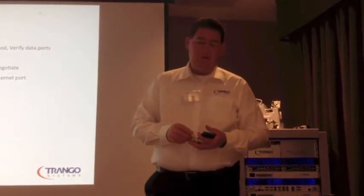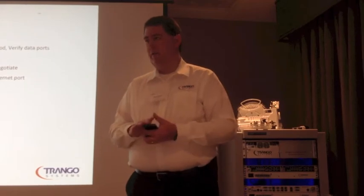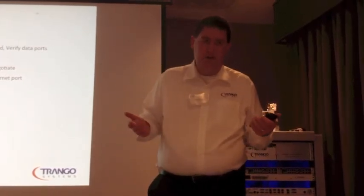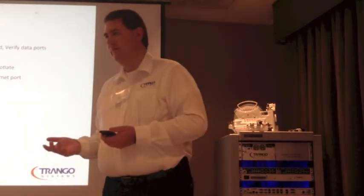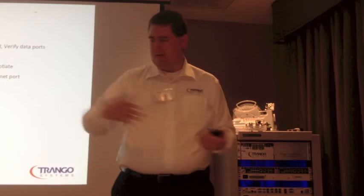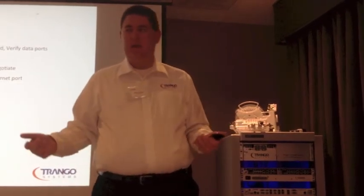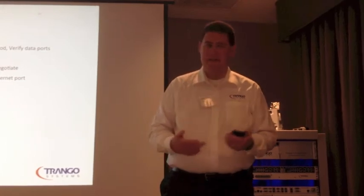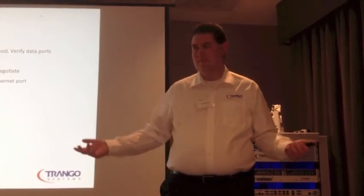Briefly, the way that iPerf works in my personal experience is that it bursts traffic at line rate. It's actually kind of the law. It's the only way it can do it. If you want to send traffic from here to there, and I've got a gigabit interface, the only possible speed for me to send it at is actually gigabit.